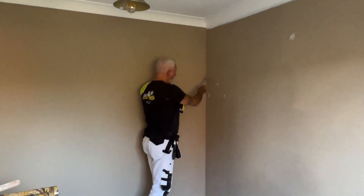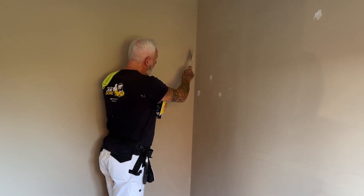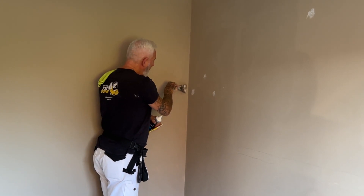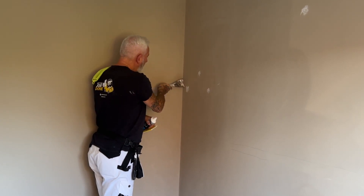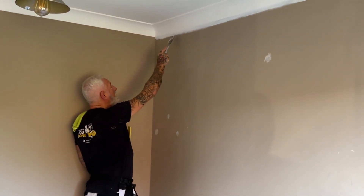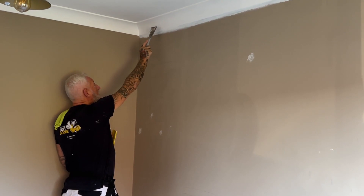If your wall moves in and out ever so slightly, when it's not a perfect angle and you paper up to it, you don't want to see the old color between the new color and the wallpaper. So if you're painting this wall, bring it around an inch or so onto this wall here. As with the ceiling, I've repainted this — I haven't repainted the whole ceiling, but this morning I just painted this bit of coving.